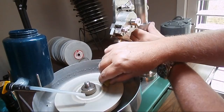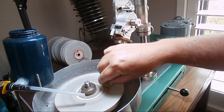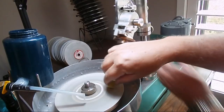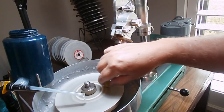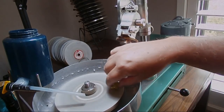As you can see, I haven't preformed the rough gem. Sometimes I go about the process of preforming it into a shape. All I've done this time is just drawn out the shape or the basic outline on the top of the gem, glued the dot on, and I'll do the preform all from the machine by grinding out the basic rough shape out first.